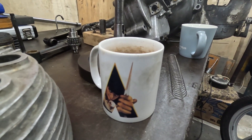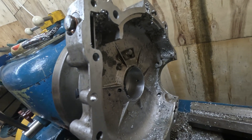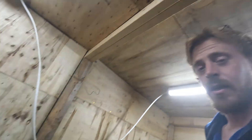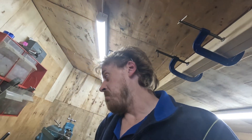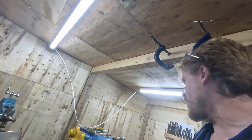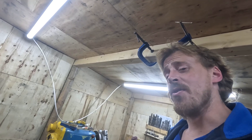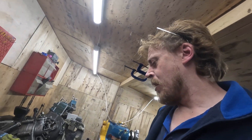Okay, so I've done another cleanup pass on this and just deburred it. Still not happy with it. I've had a bore gauge down there and it's half a thou taper on it and half a thou out of round as well. I might just leave it till the morning and re-measure it, when I'm not quite so annoyed with it and it's definitely cooled all the way down. So we'll worry about it then.